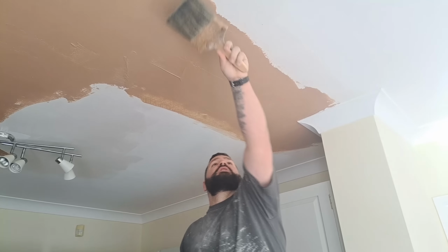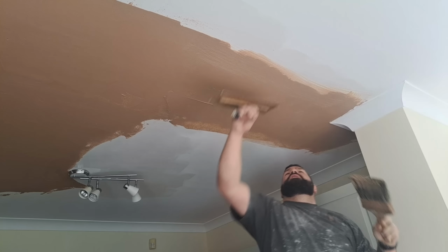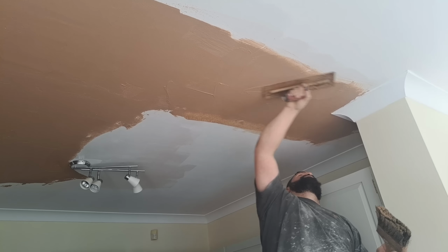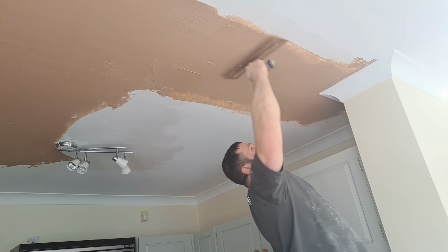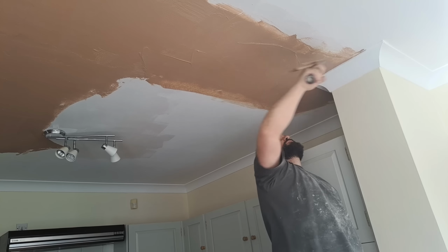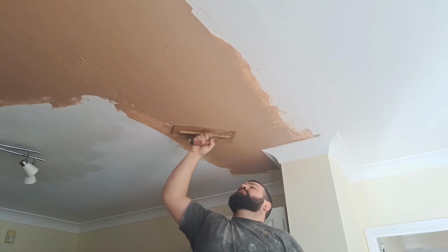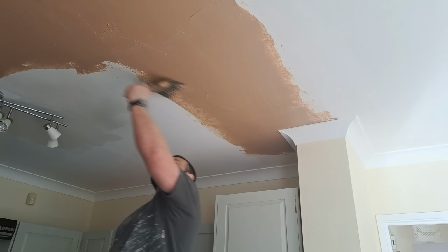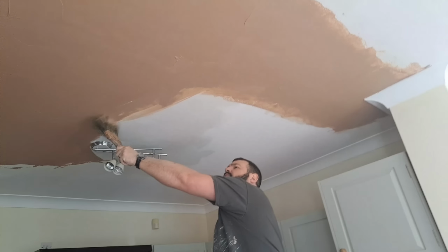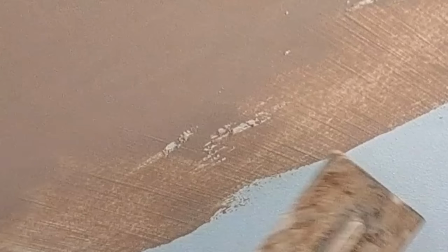It will tear a little bit if you use the accelerator where it's blending in, because it will be drying out quite quick on that joint. I'm not so much worried about the middle part, I'm more just focusing on the blend at this moment in time. See the tearing? See it there? It will happen. Just keep wetting it